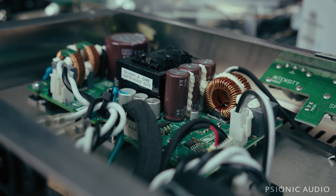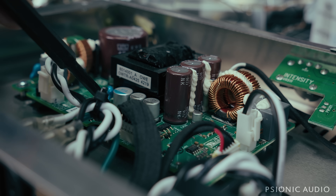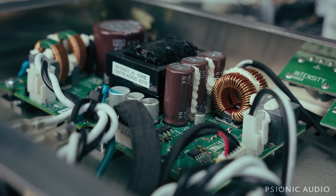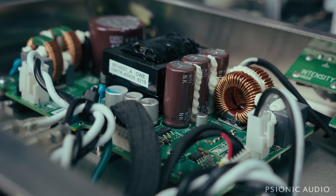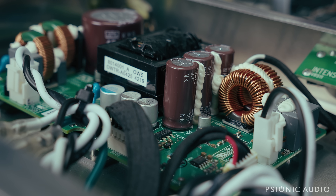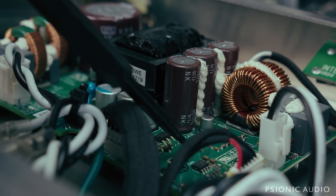I just took this thing outside in nicer light where I could really see things even better than here on the bench. I looked through the entire amp to see if there's any component that was dark, discolored, burnt, or anything. Sometimes these things have obvious telltale signs — I've not seen anything. Then I did some research, and apparently no power and a flashing red LED for the software update function is a pretty common failure mode on these. Most people have found that when they contact Fender, it is a bad diode in the power supply, which would indicate a diode is bad on this ICE module.